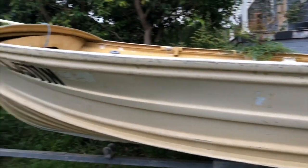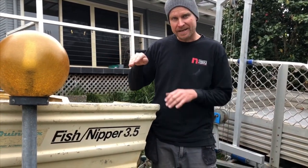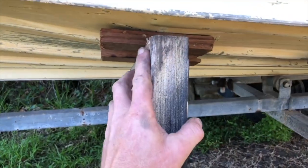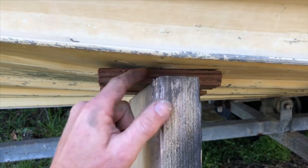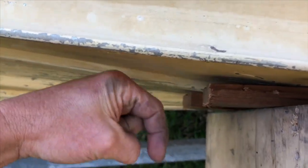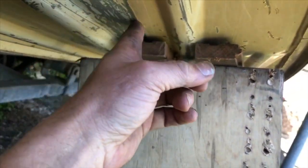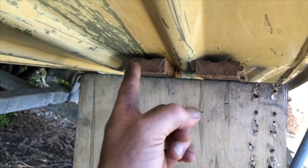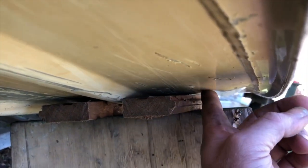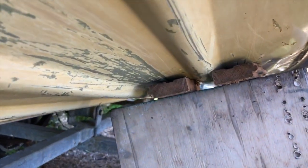I'm here with a fish nipper and I'm going to get into beating this bottom back into shape like it's supposed to be. I've supported with a piece of timber this part here where it's on the rib, and this is the part that I want to hammer back down. You can see it's because they've been punching it here with the trailer skid.